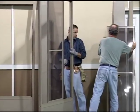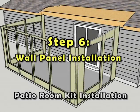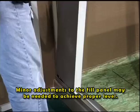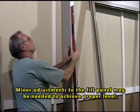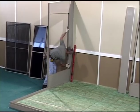Step 6: Wall Panel Installation. Starting with the end wall that does not have the panel containing the door, start the installation process at the existing structure and work towards the proposed front wall. Identify and locate the appropriate fill panel. Place the fill panel into the base cap expander and slide over and into the previously installed female wall channel attached to the structure. Confirm and maintain the level of the fill panel. Install the first wall panel by placing it into the base cap expander.